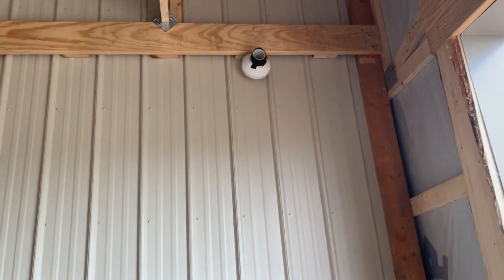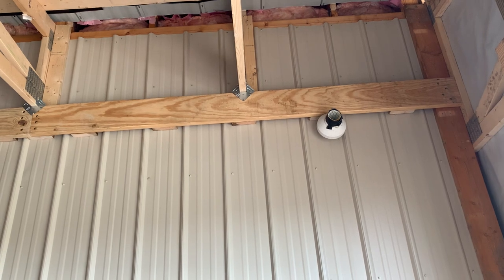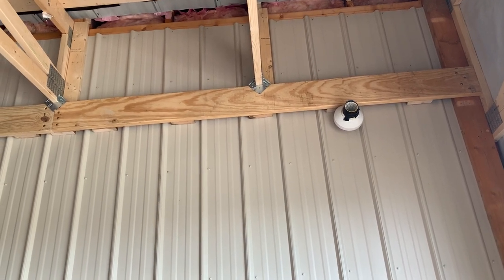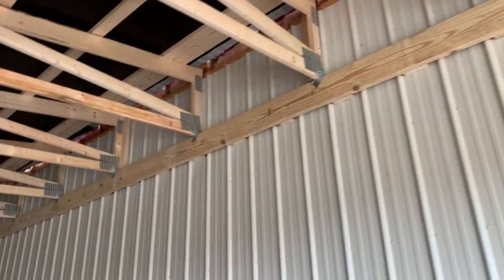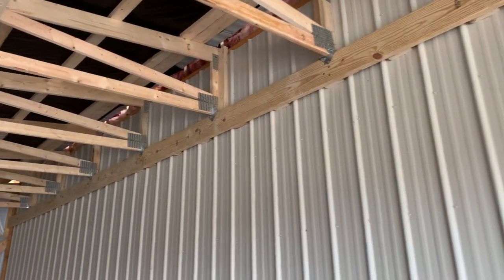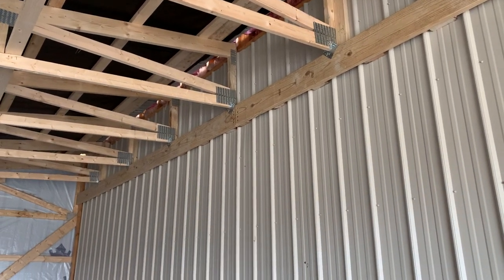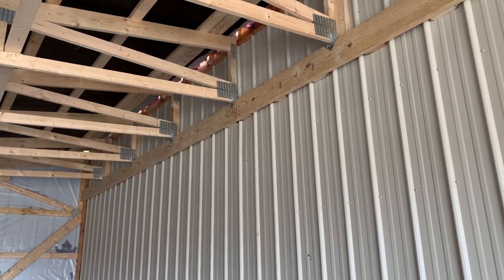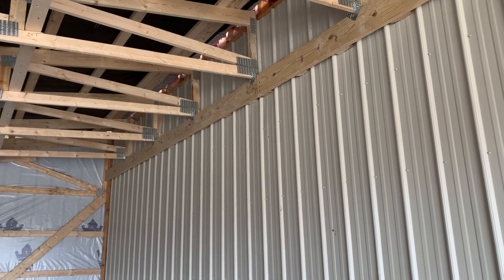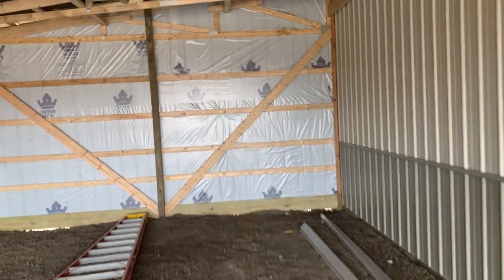You can see what we did right there — we put that 2x8 board right there below, and then we put the mono trusses right there on top of that. For you DIYers who want to get that done with a building you want to extend — it's a little more nuanced than a freestanding building. There's some detail on that. So again: 2x4, 2 feet apart.